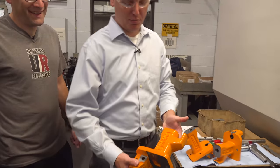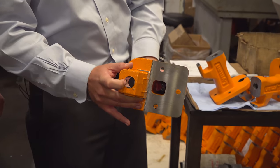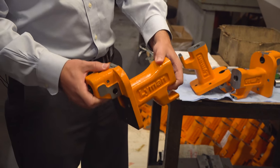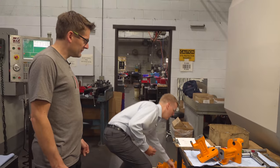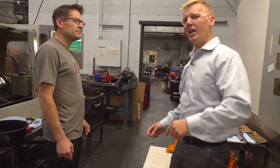It's a little messy and oily, but here's the press as it comes off the machine. The bottom's decked, the hole for the ram is drilled and reamed, you have the surface for the primer, the top for the turret. After this, it'll get cleaned, it'll get rust preventative, and it'll go to our assembly cell area.